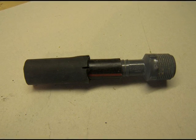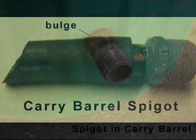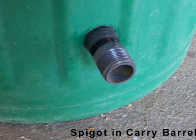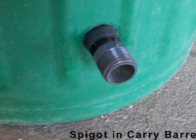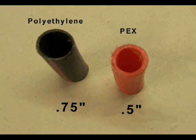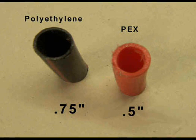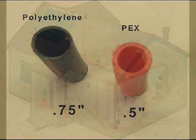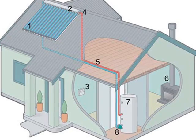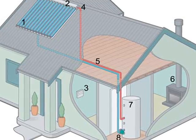Next, an adapter is added to facilitate the pump connection. We could push the spigot into the spigot hole first, but if we do this, the protruding spigot inside the barrel will make the 100-foot long tube insertion more difficult. A PEX tube may be used instead of a polyethylene tube, but the heat exchange rate of PEX will be less than polyethylene, and PEX is also more expensive than polyethylene. Water pressure on the spigot is very low, but water pressure inside the heat exchange tube is very high. For this reason, the heat exchange tube junctions should be carefully prepared to avoid plumbing leaks.